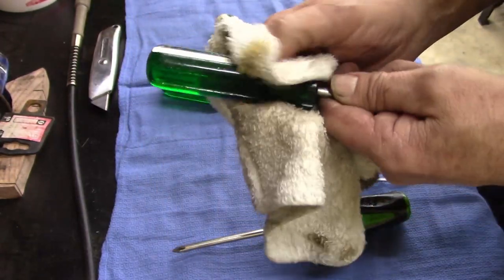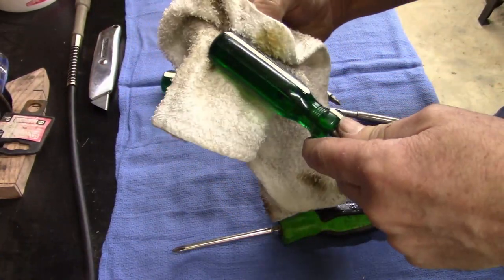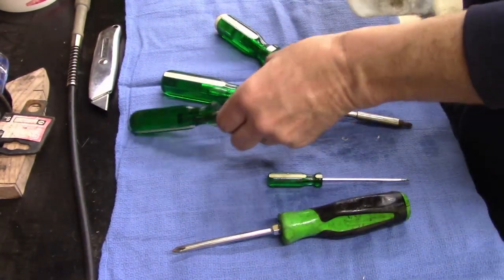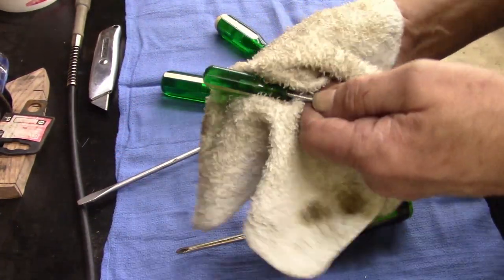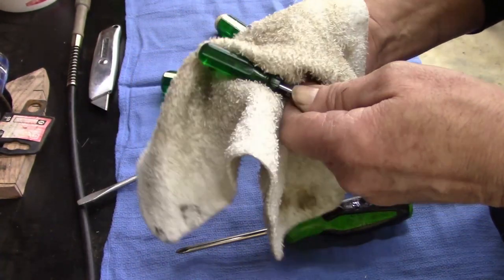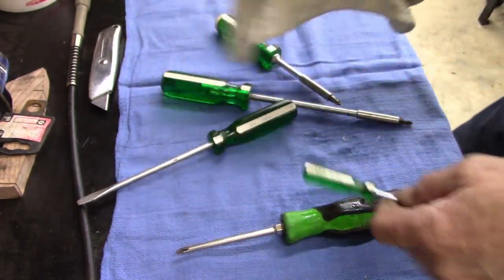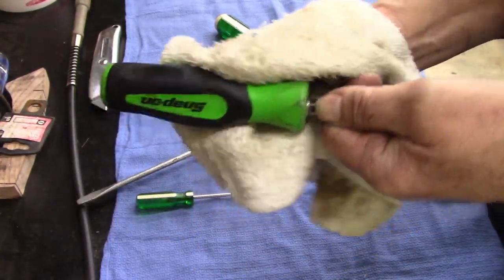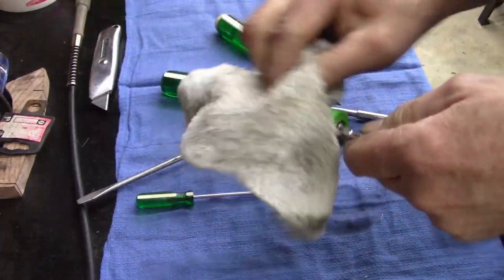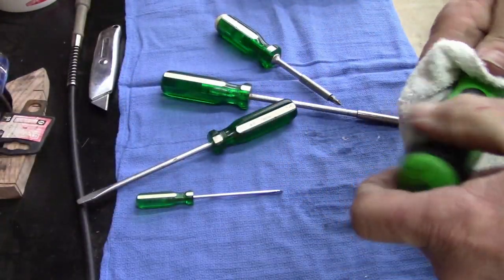And we've got an air conditioner in our building. You guys ain't gonna believe this. It was installed in 1958 and we're still running on it. That's a good PMI maintenance schedule, buddy. We've got it down. Replaced the fan controls, replaced the coil, replaced the actuators, you name it. A lot of that old stuff works off of pneumatic air. Thermostats work off of pneumatic. That stuff's a booger. Very few people know how to do that kind of stuff anymore. Get these guys that come in and they scratch their head when they see it. You can tell he's not been in the field that long.